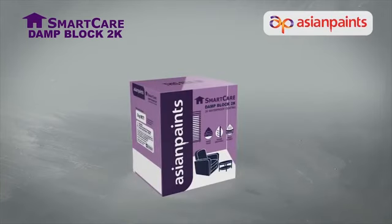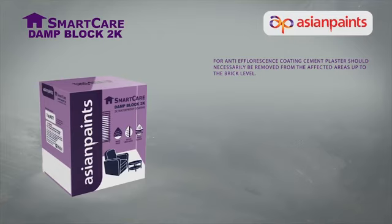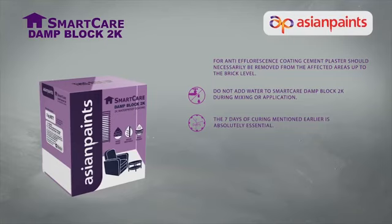While using SmartCare Damp Block 2K, certain precautions must be taken to ensure that the product is fully effective. These are as follows. For anti-efflorescence coating, cement plaster should necessarily be removed from the affected areas up to the brick level. Do not add water to SmartCare Damp Block 2K during mixing or application. The 7 days of curing mentioned earlier is absolutely essential, after which tiling can be carried out. Do not conduct any bonding test before the applied product gets completely cured.